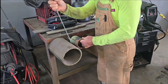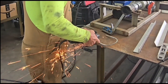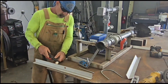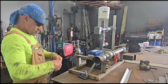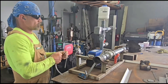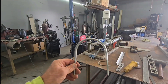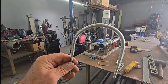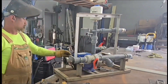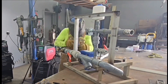This is a bender I'm showing you here, normally used in a different way, but you see what I'm doing — jamming this piece of three-inch pipe in there. I'm making U-bolts because I couldn't buy U-bolts in the size I needed for this tank. I'm getting my marks using a square and holding it up there. On these U-bolts, where they're going to go on this tank, I'm covering the threaded rod with vinyl tubing to serve as a softener. To get that on there I had to thread it on in two separate pieces — you can see that separation in the center — but this is going to provide a nice softener around that tank.